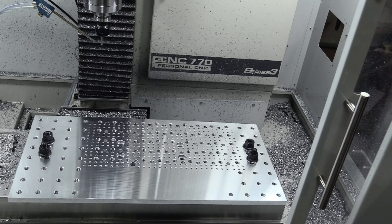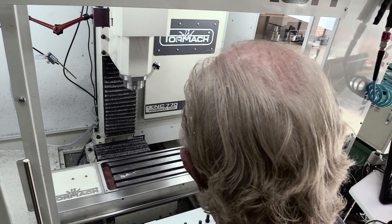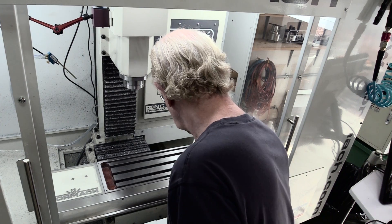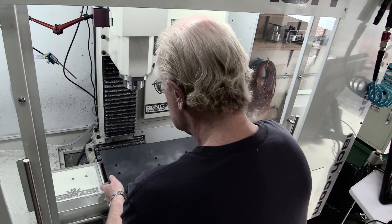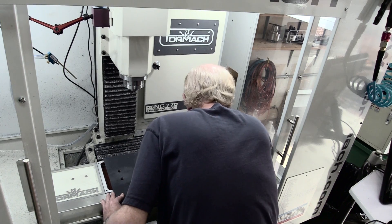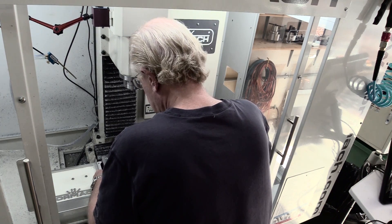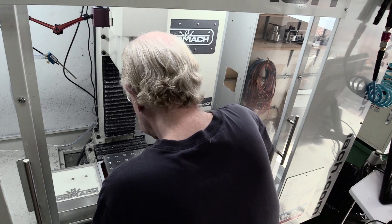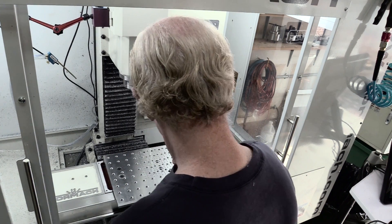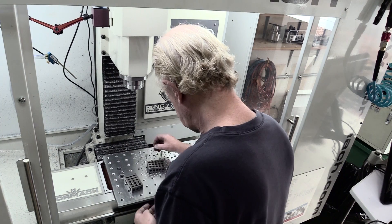That side of the fixture is now complete. Before I mount the fixture plate permanently, I'm going to spread some WD-40 on the mill table — this is just to prevent rust. I've also cut a piece of 3/8-inch PVC to place under the fixture plate. The reason is I may want to drill additional holes into the fixture plate as I'm using it, if I need new holes in different places, and I certainly don't want to drill into the mill table, so this gives me a cushion under there. I'm bolting the fixture plate down to the T-slots in its final position, and off-camera I machined the holes for the bottom of the plate, so it's actually completed now.